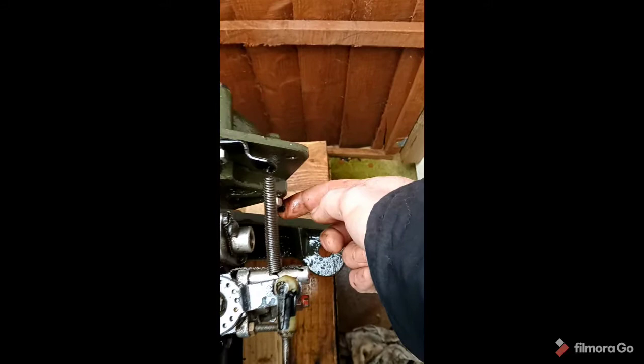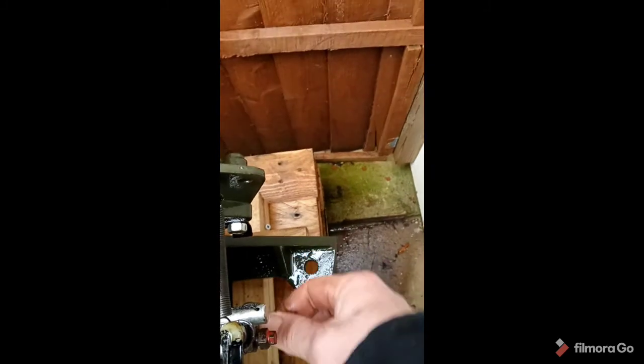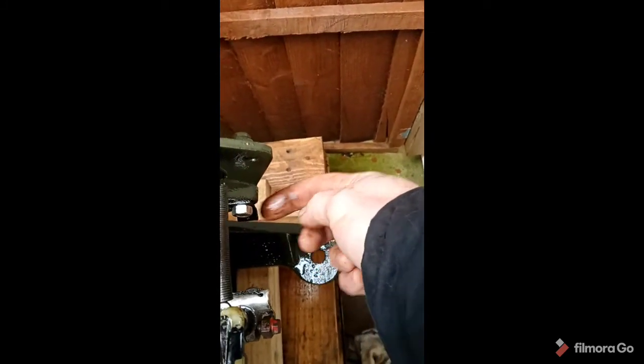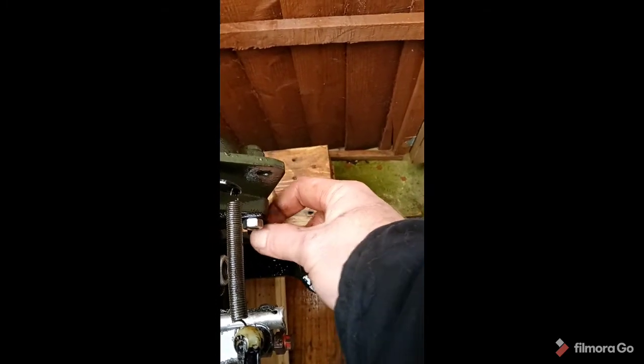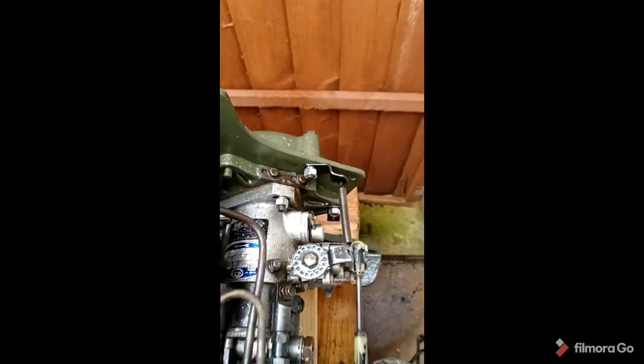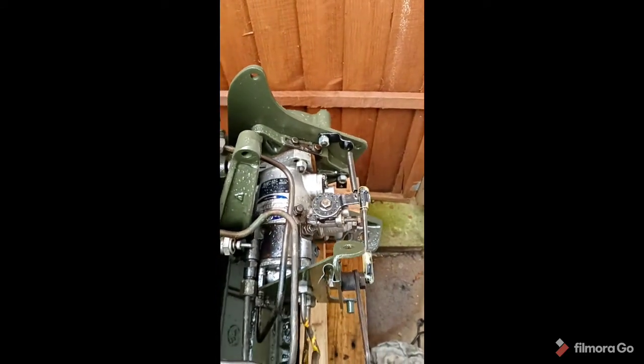Got to order one more spring then, but we've mentioned our stop control down here, our fuel cut off. It's not on a return spring at the moment, but again, that lower plate at a 6 o'clock position, pointing down with the eye or the hole there, corresponds with the control down there. And that will be our stop control down the bottom. But in essence, that's the fuel injection pump nipped.